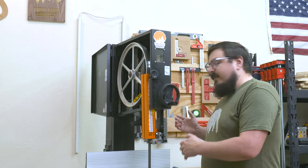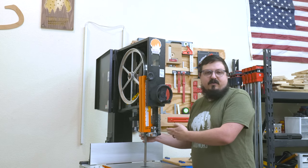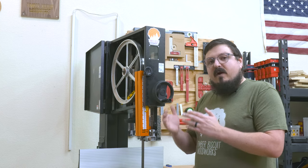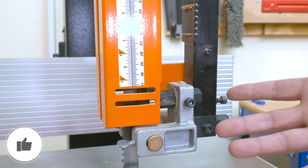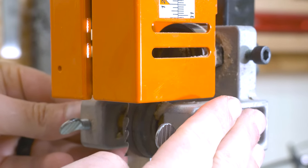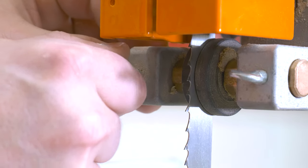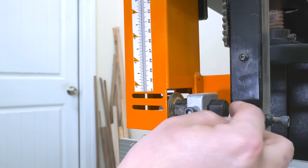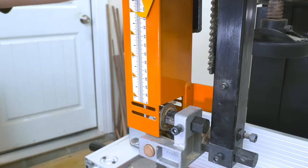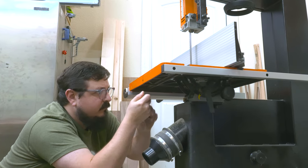This is the most important part of the process, so make sure you're taking your time to get it right. A lot of these guides are different from bandsaw to bandsaw, but we can get close enough on each type so that you can adapt this to your saw. Basically, we want two side guides to run along either side of the blade right behind the gullet, and then the rear guide right behind the blade so that when the blade is spinning, there's no contact with any of the guides at all. Touch them to the blade and then back them off ever so slightly. Now the upper guides are set up — do the same to the bottom guides, with side guides right behind the gullet and the rear guide right behind the back of the blade.